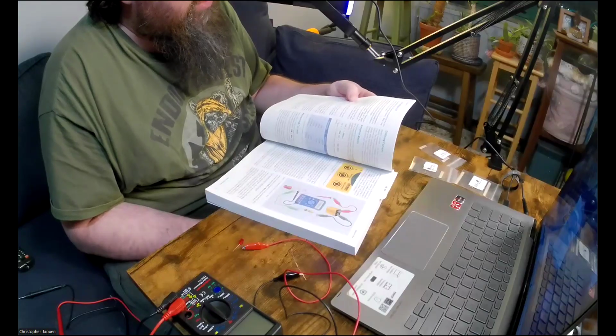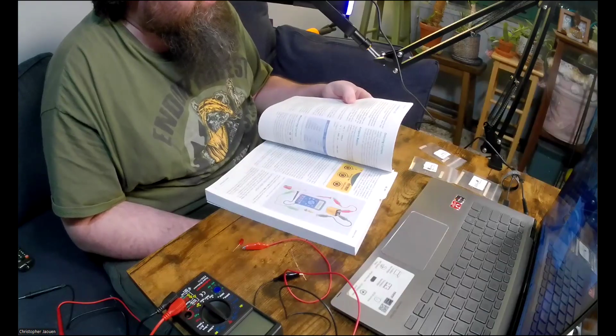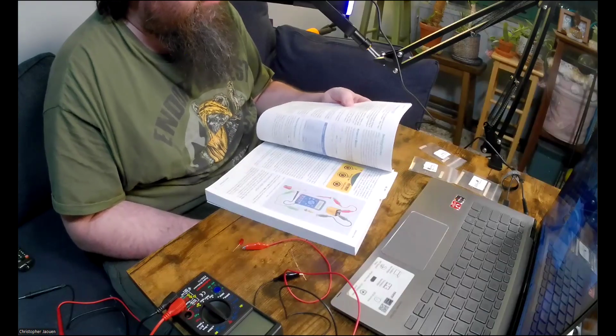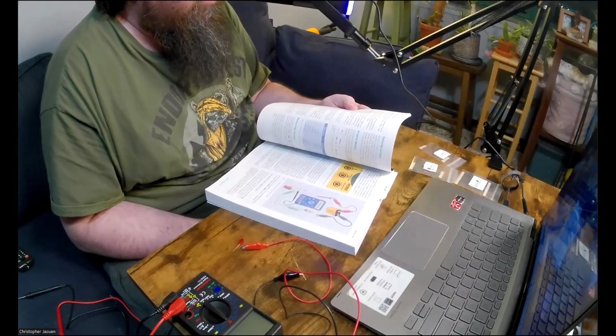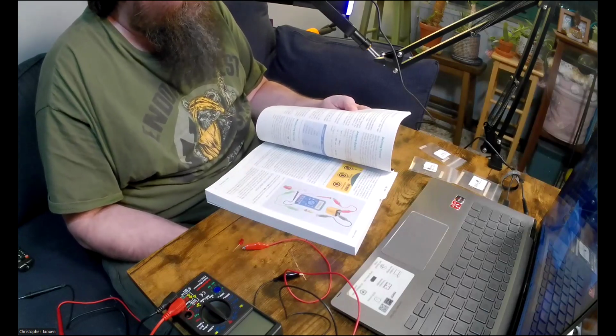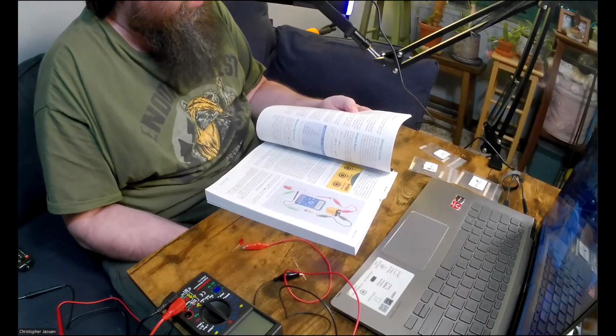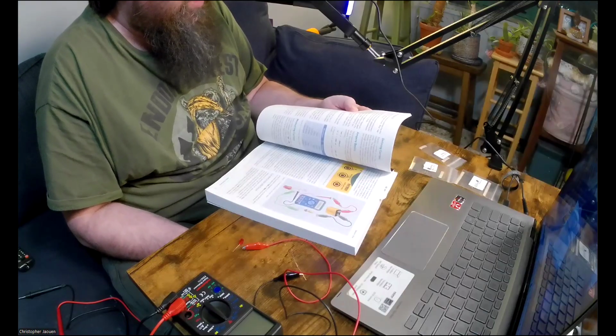So that when you applied the 9-volt battery, you got more of a tingle. Reducing the resistance in your circuit gives your LED more of a tingle. Do you think you can make it even brighter? Maybe you can guess what will happen, but guessing isn't good enough. Remove the 150 ohm resistor, substitute the 15 ohm resistor, but don't touch the wires together yet.